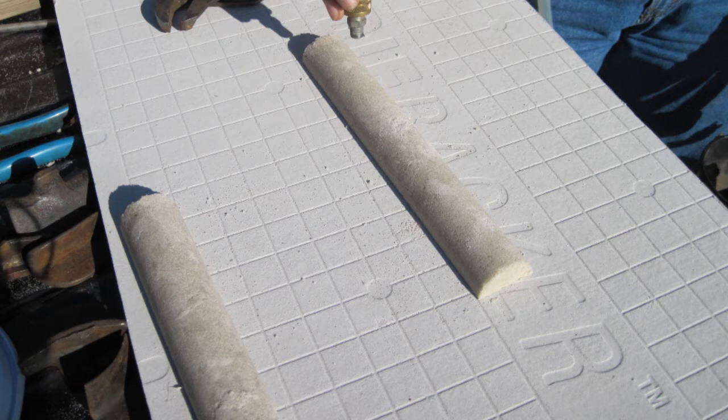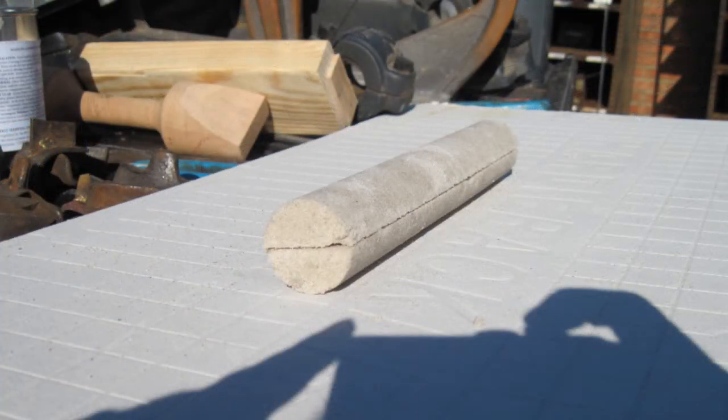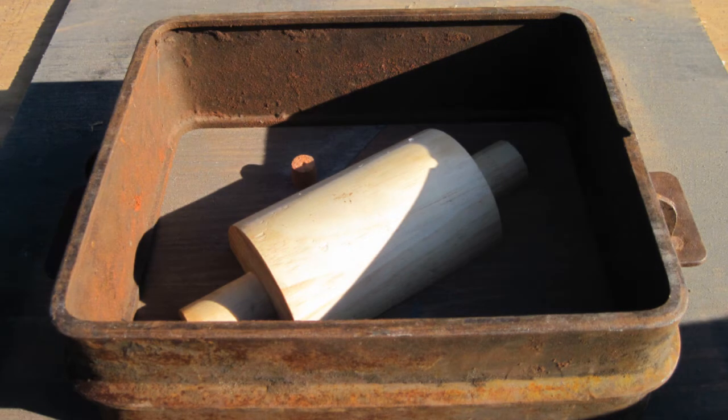Here's a picture showing the two halves. The binding material we were using hardens with carbon dioxide, so we have a CO2 tank and we're exposing those to a high level of CO2 so it would harden a little bit quicker. And this is the actual finished core.